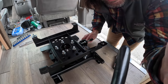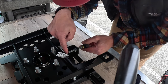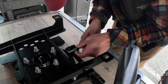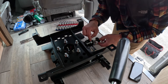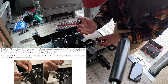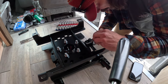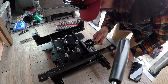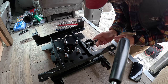What you do is thread these two jam nuts on the threaded lock handle until the end of the handle is flush with this arm here. Come back a little bit. Once you've got the threaded lock handle flush where it needs to be, and the jam nuts are in position, grab two 9/16" wrenches — hold one in place and tighten down the outermost one. I don't have two, so I've got a little adjustable wrench and it seems to be working.